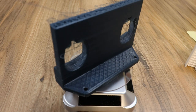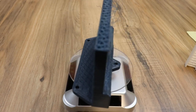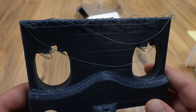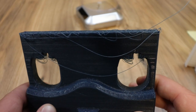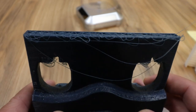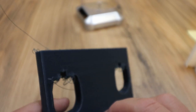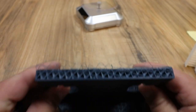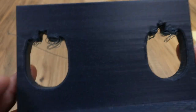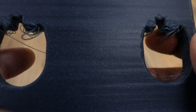I did have a failure — I was printing a bracket for some Ryobi batteries found on Thingiverse, and I'll put a link to everything I've shown along with the filament I used. With this particular print, you can see I had some issues with cooling on the underneath where it should be bridging. At the top, I had a pretty nasty layer shift and it was almost done. I hit the control button on the printer to go back to the home page — I'm not sure why it showed me that option, but it did, and for some reason it layer shifted. I had to stop it. I could still use the part. I wanted to show it on camera. Otherwise it printed really good — the layers are nice in there, though I needed more top layers to get rid of that infill. The sidewall looks pretty good — it's a heck of a print, and I wish it would have finished.